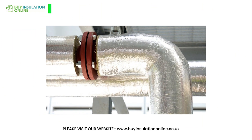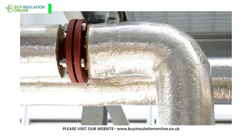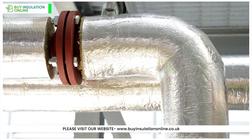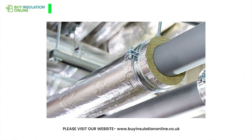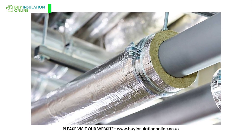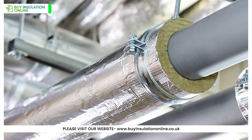To tackle 90-degree bends on pipework, simply cut the pipe insulation at 45 degrees on both sides of the bend. They'll then link together tightly and securely, using insulation tapes such as aluminium foil. To address T-joins in your pipes, just cut a 45-degree notch in the pipe at the top of the T, and then shape the end of the connecting insulation to fit. For the bends, it's best to use a mitre box if you're inexperienced. These are relatively cheap to buy and will save you a lot of trial and error.